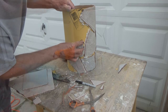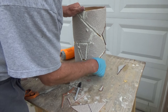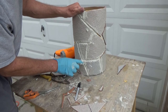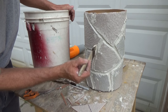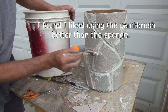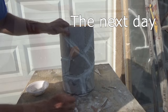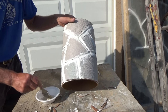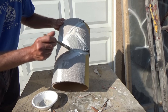I'm doing the same thing — before I go too far with my joints, if you don't want to use a sponge, get yourself a little water on a paintbrush and go over your joints like that. A real soft paintbrush — that smooths them off real nice. Now it's the next day. I'm looking and just checking my joints, so if I see anything bad I just mix up a little thinset and go over them again — just the bad spots.